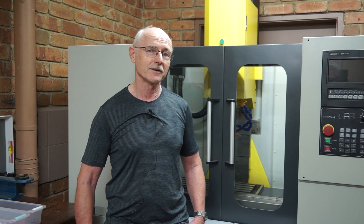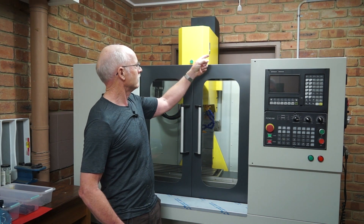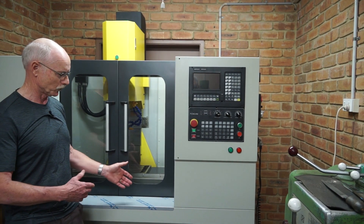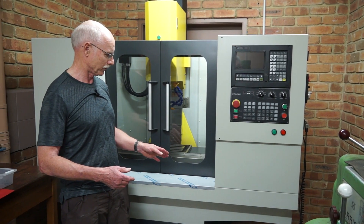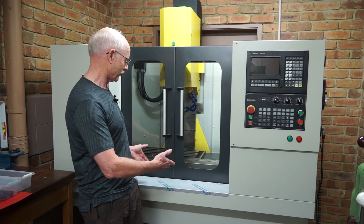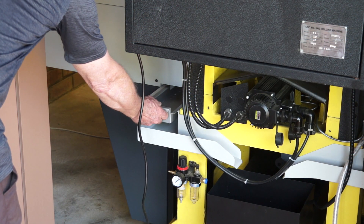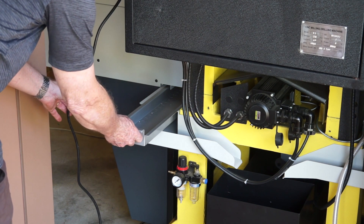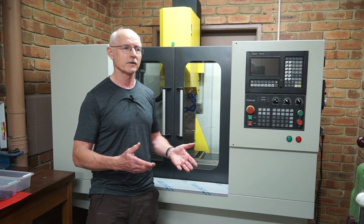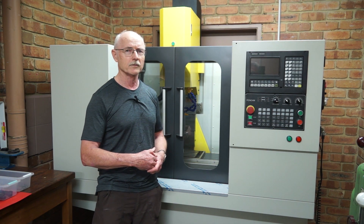When I bought this machine, it came without an enclosure. You can see, if you look over the top of the machine here, that we've got a wall right behind me and in the wall we've got a door. I've got a very tight end here to accommodate the machine. So I didn't want the swarf coming to the front, and the idea came to me to put gutters on the sides of the machine base, allow the coolant to run into those gutters, then direct it to the back and into the coolant tank. Having conceived that, when I started to design it all the problems evaporated fairly easily. It turned out to be a fairly sound approach because there were no insurmountable problems, and I'm quite pleased with the way it's come together.